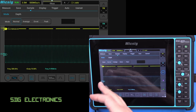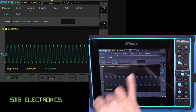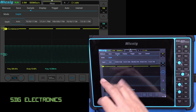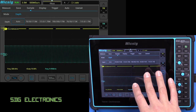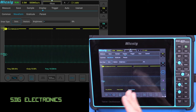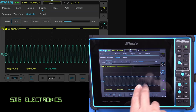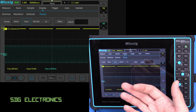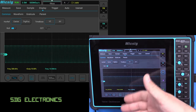Then there are the acquire options, where we can choose the mode for acquiring waveforms — so we could do averaging, which is useful if you've got a particularly noisy but repetitive waveform — as well as envelopes and peak detection. We can also choose the memory depth; when set to automatic it records the maximum for all channels, though using more channels eats up the available memory per channel. The display options let us draw as dots — every individual sample point — or as vectors, change the grid intensity, and enable persistence. Under common settings there are references, and we can change between XY mode or amplitude and time.